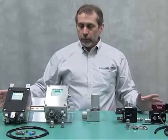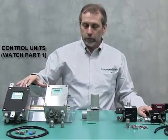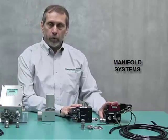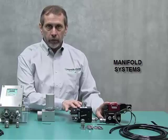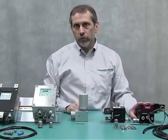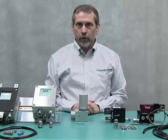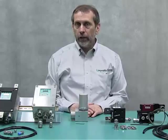That completes the explanation of the components for the 5500 Series System. We have the control units with the mounting hardware — external and internal mount — the vent which is a pressure relief, required for the Type-Z EXPZ system. We also offer these optional manifold systems for purging and pressurization of the enclosure. You can certainly use manual valves or your own valving system, because the purge flow is based on the pressure inside the enclosure as measured through the control units. These units are certified for ATEX, IECEx, and NEC Class Divisions — Class 1 Division 2 and Class 2 Division 2, Groups A through D and EFG, as well as Zone 2 and Zone 22, making them suitable for gas and dust atmospheres.